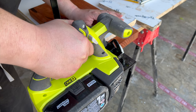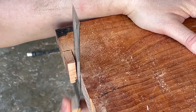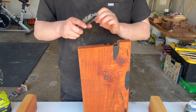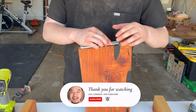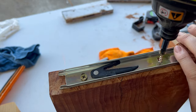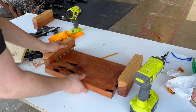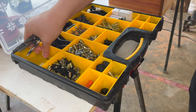You may have noticed I've been backtracking at this point. I already placed the finishing oil on the wood, but I wanted to hide the drawer slides from plain view, so I ended up cutting a few recesses into the sliding drawer pieces. After dry-fitting the pieces together and making sure everything looked nice, I put the pieces together using a pocket hole jig and self-tapping screws.